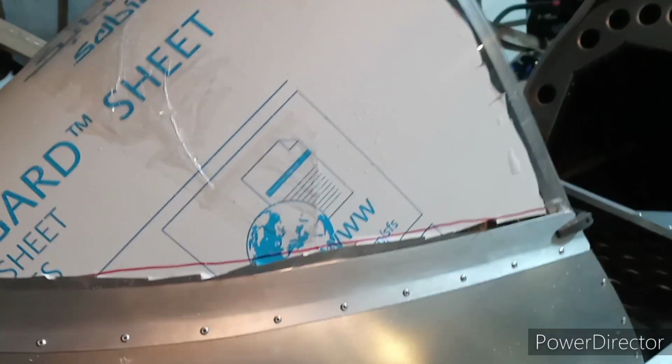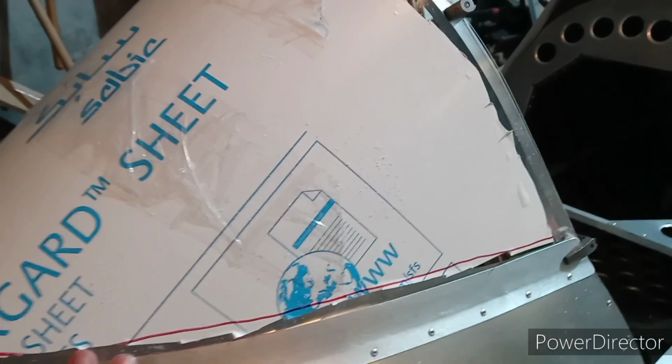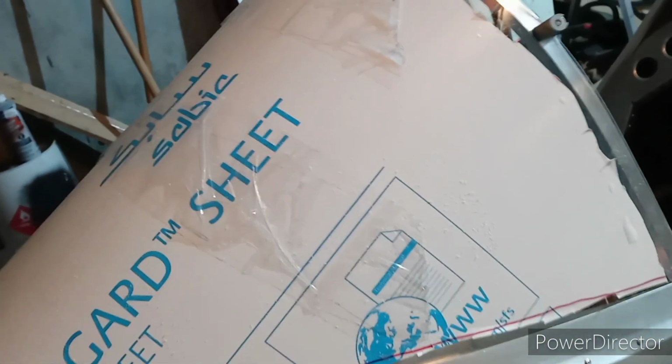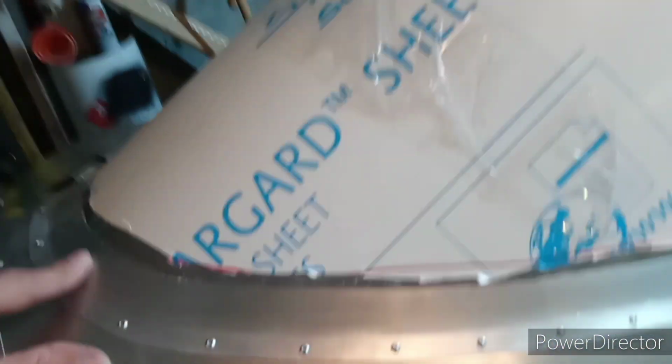But they were telling me, because on the first Ultra Cruiser, and probably 2 or 3 windshields into it, it's over 1,600 hours of flying, I'd replace the screen periodically. Because once this is in there, where's it going to go? It can't pop out here unless the windshield gets bent back that far, but I think you're going to know that. But anyway, and this is just me, I'm not telling everybody to do it, but I don't put rivets in here because I just feel that's giving it another place to crack.